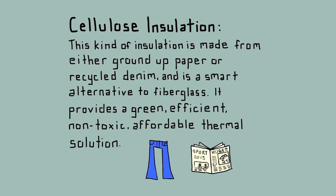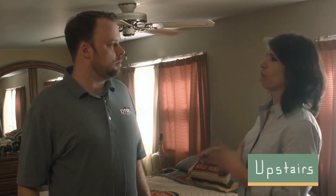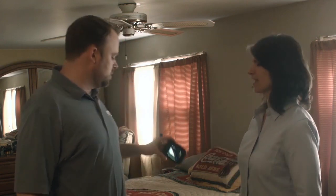Is there a reason you have to do this from the inside, or could you do it from the outside as well? The liquid foam on brick homes we do from the inside. For a frame house we could do it from the outside, if it doesn't have asbestos shingles — but a lot of these vintage homes have asbestos-type shingles underneath the siding, and a lot of them have no insulation at all. So John, how can you tell if a wall has already been insulated — is there a way without tearing the walls apart?